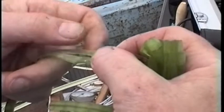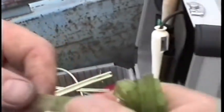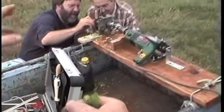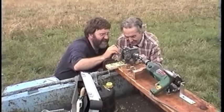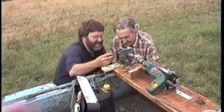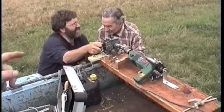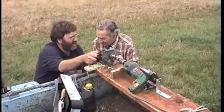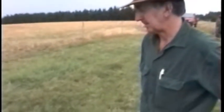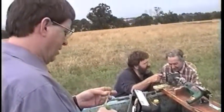See, what I perceive is this: it comes through here, and it meets... so what do you need, the hump guide? Need to take the machine arm and do a bit of modification. Oh, well, this one has really been obsoleted already by a new design that we have, where these things catching won't happen because it's only mounted on one side, not both. What our goal today is, when we actually finish setting it up, is to measure the energy it takes to do these. So we know how much energy has to be transferred through power takeoffs and whether we need 100 horsepower or 50 horsepower. That's what we've got to establish today.